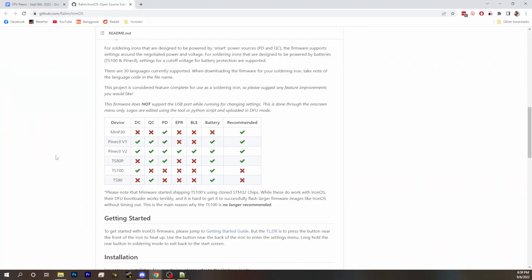If you're ordering a TS100, we're going to give you some information and you can decide what to do with it. Some new TS100s have been shipping with clone MCUs — the STM32s are not the proper STM32, they are a clone from a different company than ST Microelectronics. In some cases this is not a problem, and in some cases, as we'll see with the note under the table, it is.